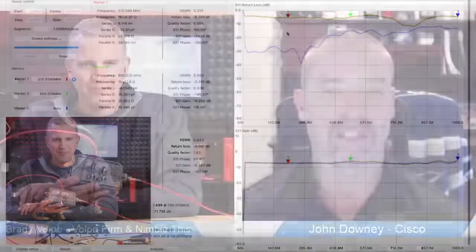So this brings up a question I've always had. I know the design of a tap to have four ports. It's really two splitters to create the four ports. Then those two splitters go to the other splitter to have it again, because there's no through leg on a four port 8 dB tap. It's a self terminating tap. So it's a splitter feeding two other splitters. So my question would be, is the signal level you're on, the port that's unterminated on that first combining splitter, more critical than the other one.